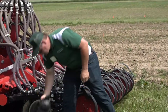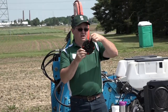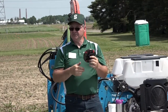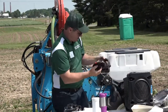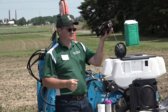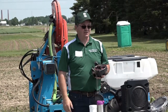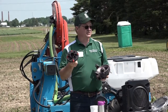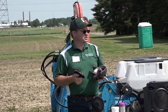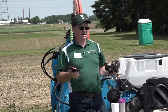The biggest challenge with the Horsch singulator is you have to size the seed. If you get one seed in a pocket and another partly stuck, and that thing spins around to where it drops, it shears off the seed. Then you get a buildup of seed debris inside the chamber, and eventually a buzzer comes on in the cab telling you that you've got a plugged singulator. Every one of these planters has drawbacks. The biggest one for the Horsch is you have to actually size the seed. We did that with wheat — we had it sized perfectly by Michigan Crop Improvement — but then we treated the seed and everything changed. It wasn't all the same size anymore. I don't know how we're going to address that issue.